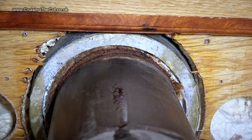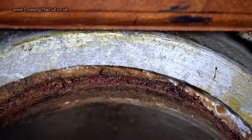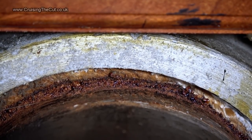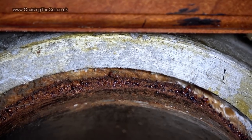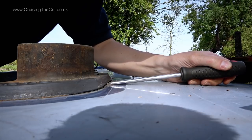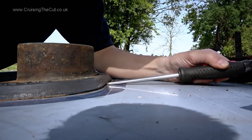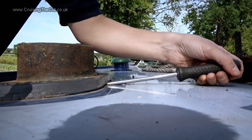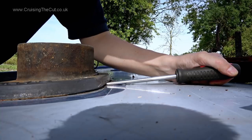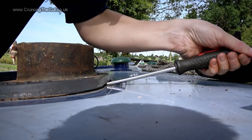At this point it rained again, so I could see exactly where the leak was. Not between the flue and the collar, as some had suggested, but, as I thought, water creeping underneath the collar and then dribbling down its side. With the bolts removed, taking up the collar should be simple. Yes, there'd be some old sealant under there, but a bit of leverage should sort that out, or so you'd think. No, it really didn't want to lift off, did it?